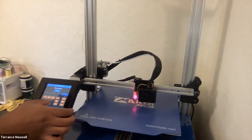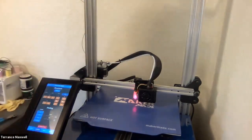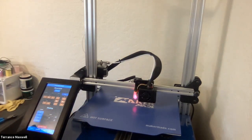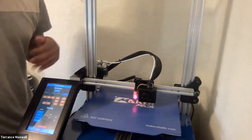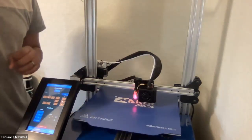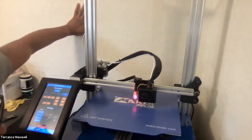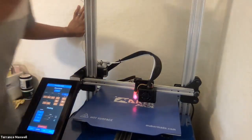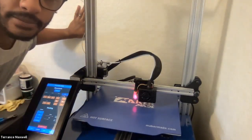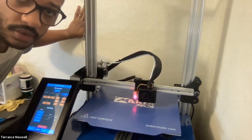Okay, yeah, I think the troubleshooting issue is fixed. Do you see it coming out when you tap it? Do you see it coming out the nozzle? Yep, I'm seeing filament come out. So I think this is just a process that I'll have to repeat until it's fully cleared out. Correct. Is the filament white? Is it the same color? Yep, white filament. Cool. No, you're good. It's not burning, so you don't have old filament. If it's jammed, you'll start to see old filament come out a little brown, where it's burned.